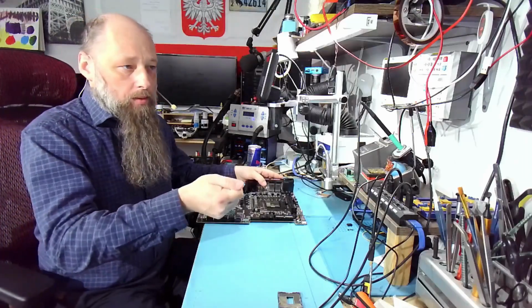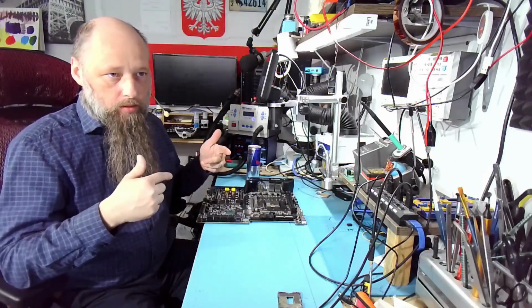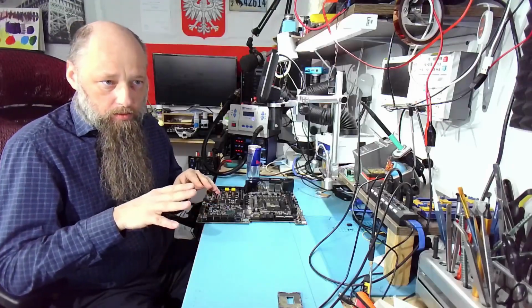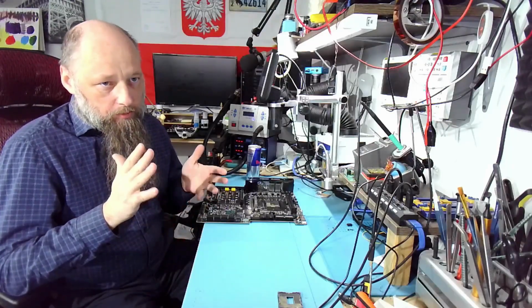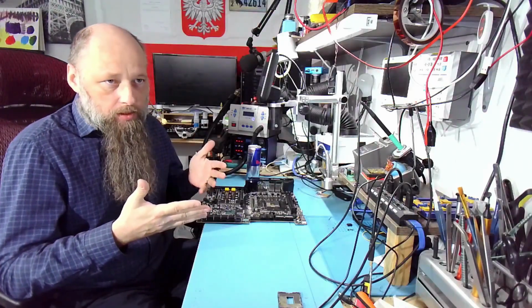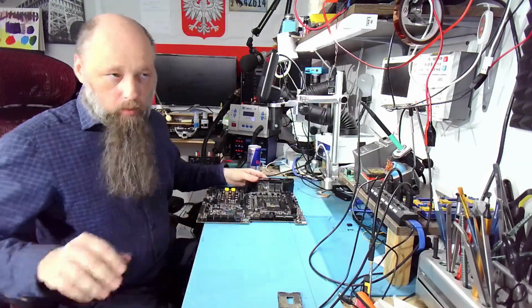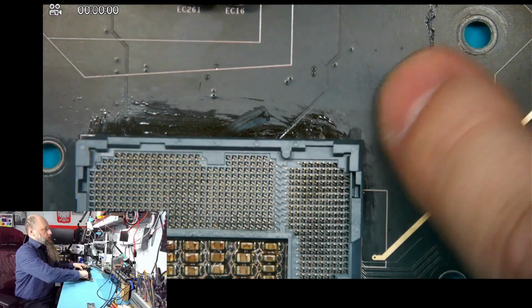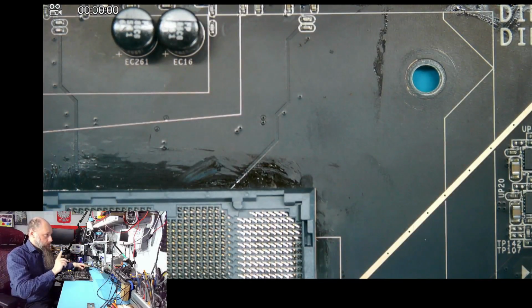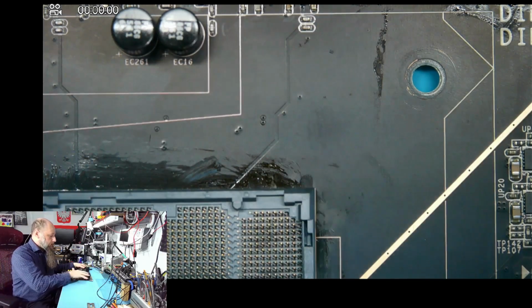Now, I don't know if you noticed, but I've been playing with different thermocouples. I had 3 points of reference. So definitely the PC410 controller trails behind by roughly anywhere from 10 to 30 degrees. So our actual temperature could be higher, and the second thermocouple was placed here in this spot, on this big ground plane. So this one was trailing behind, but that's normal because if you see that one thermocouple is trailing behind the other, always consider where it is placed.